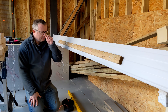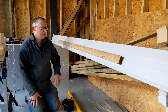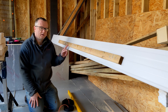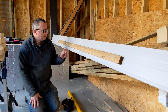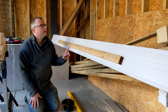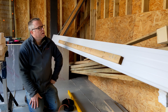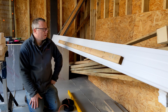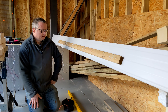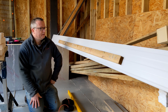This is around insulated roof panels, and specifically whether gluing and screwing a batten to the underside can carry the plasterboard. I spoke to the manufacturer about whether you need a vapour barrier underneath — they said you don't. Then I asked if I could glue and screw battens underneath to hold the plasterboard, and they said no. So what I've done is glue and screw battens underneath to see if it's going to work.